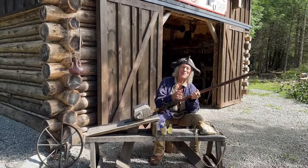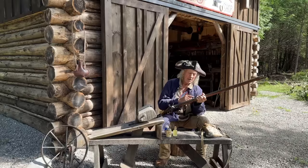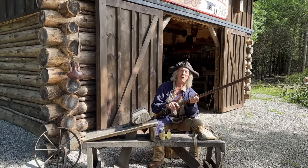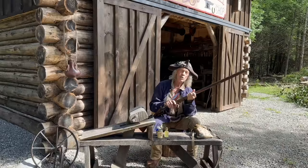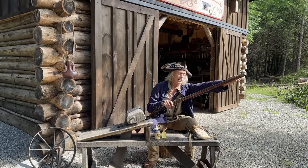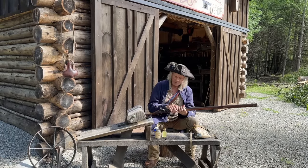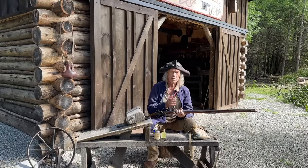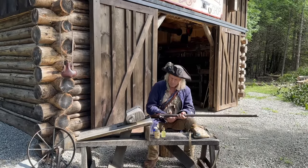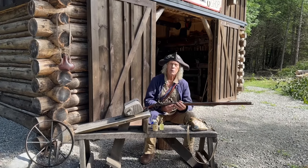So it made no difference, and so I don't have to answer another 40 or 50 inquiries about why the sights are backwards — they're right now, and it shoots the same. It was a fun experiment. It did shoot low — really low in fact. I've probably filed about half of the front sight down, which brings the barrel up, and I've got the elevation right, I've got the windage right, and now it's just a matter of working up loads.